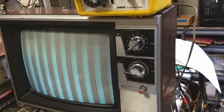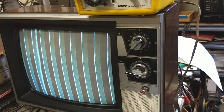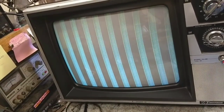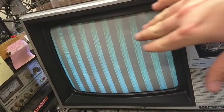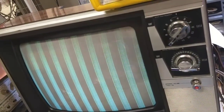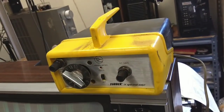Even with the subber tuner, I can fine-tune it and get my rolling color bars back, and there's that shifting bar that goes right and left. But that hum is still there — very persistent. You can see it's kind of dark up in here and bright down in here — dark at the top, bright at the bottom. So I don't think the tuner is the cause, but that was just a quick way to find out.